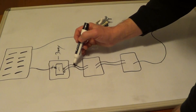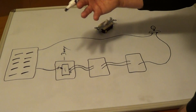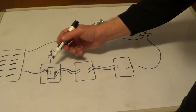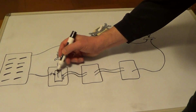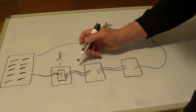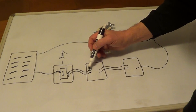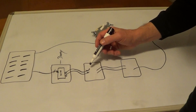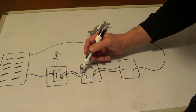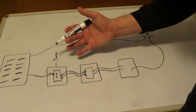Now we know that two travelers are going to have electricity coming to them. Turn the power back on and check each wire. With the switch in the up position, we'll find one wire that's hot — mark that wire. Turn the switch down, check the other wires, and find the one that's hot. We've now marked these two wires and know they are the two travelers coming into our four-way switch. Connect them to the two dark-colored screws, then shut off the electric.